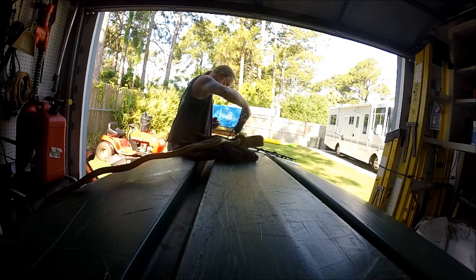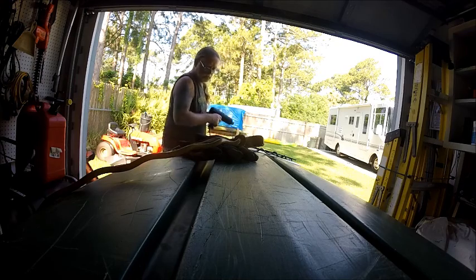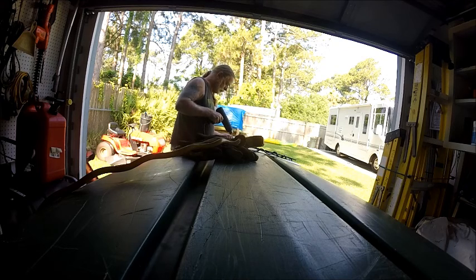The first step was to wash the area well and let it dry thoroughly. The damaged area is about 5 inches long, and it tapers from the keel's original shape to a wear spot on the back of the keel that's about 3/4 of an inch lower on one side than it is on the other. I used the wire brush that came with the welding iron to remove any loose material.